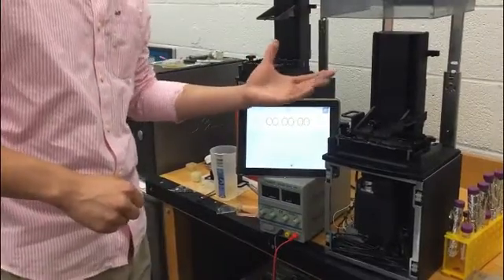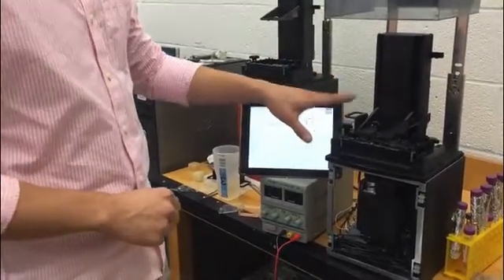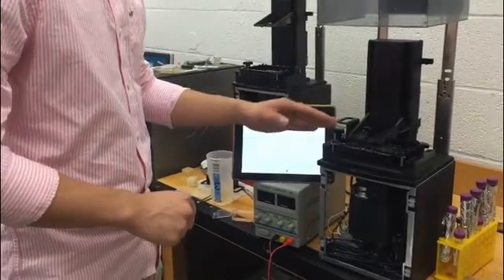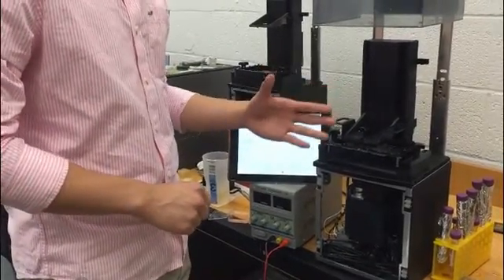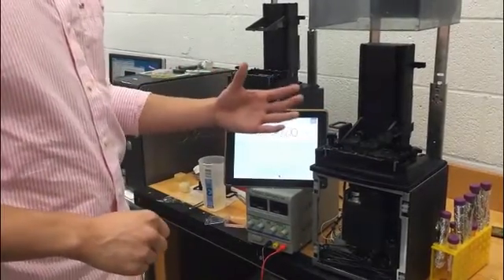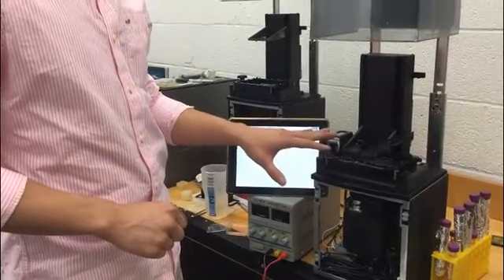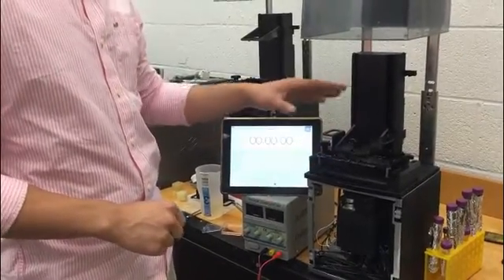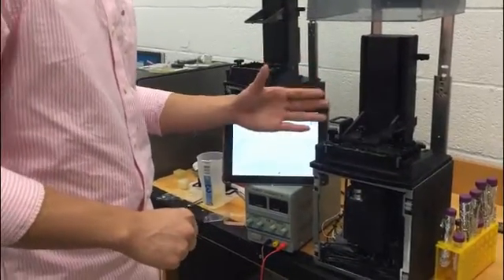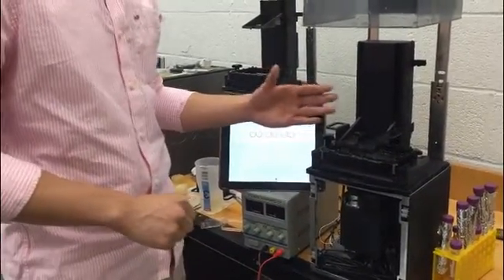the key is we need to keep moving the platform up and down, because of the surface tension of the liquid materials. But now for the continuous working method, we can lift the platform from bottom to top directly. So it means that it is super faster than the traditional SLA working process.